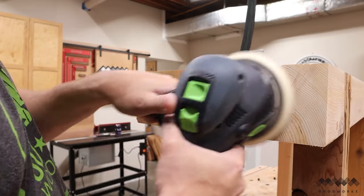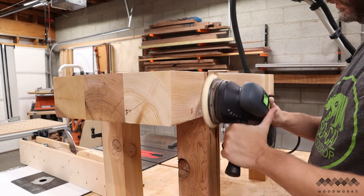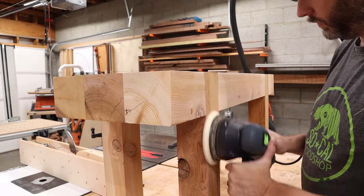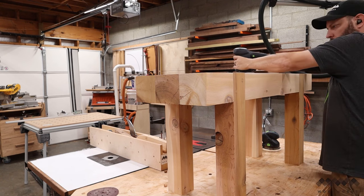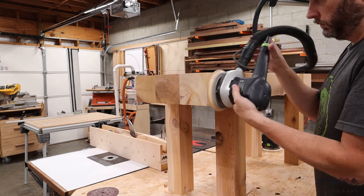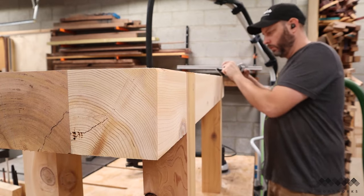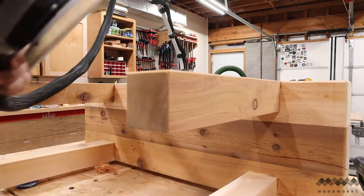And by later, I mean right now. The first bit of sanding I did was with an aggressive 60 grit disc to clean up any mill marks and sand away the glue stains at the joints — this Rotex sander is like a magic eraser on cedar. After the rough sanding, I went over the whole bench with a finish sander up to 150 grit. Since this bench is going outdoors with a heavy film finish, it doesn't really make sense to sand higher than 150 because you're only going to be feeling the finish in the end, not the wood. I went back and broke the edges with a hand plane where I could and used my sander in hard-to-reach places.